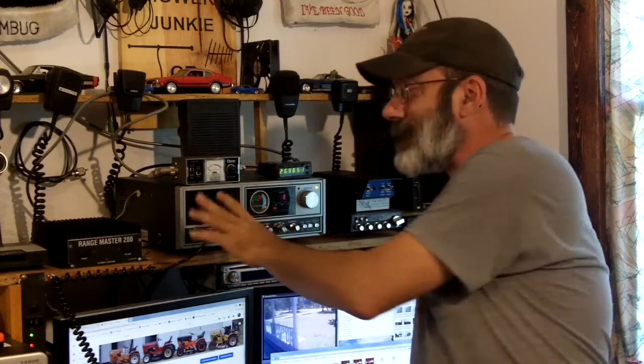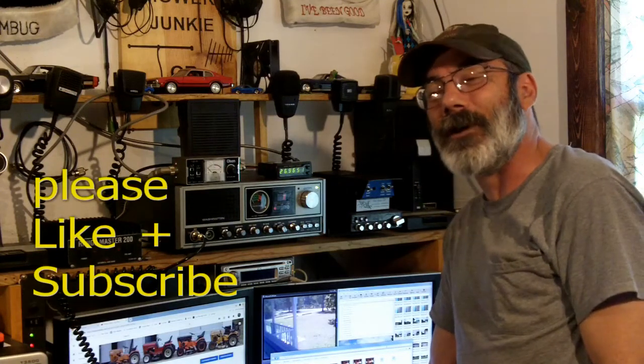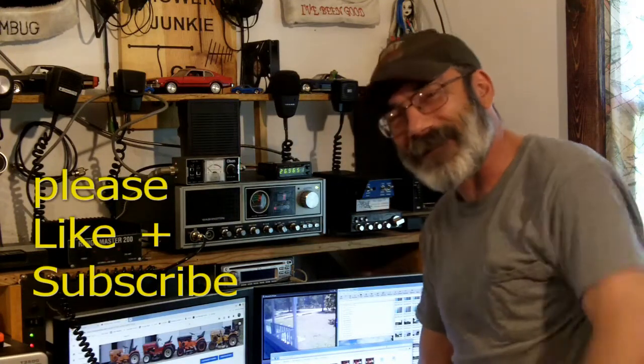So that's my understanding of SWR — that's how you set the meter, why you have to calibrate the meter, and why SWR is important: because a high SWR means power is bouncing back to the radio. You don't want any of that power coming back in — we want it all going out to the antenna. See you out there in DX land or your locals. Thanks for watching. I hope this helped. Let me know in the comments if you thought this was useful or beneficial to you. 73's for now, we'll see you next time.